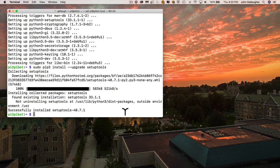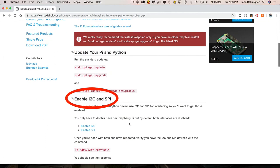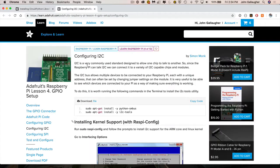When you're done, open your web browser again. Scroll down and the next step refers to enabling I2C and SPI. I2C is pronounced 'I squared C.' These are two mechanisms the Pi uses to communicate with things attached to it, like motors and sensors. Right-click where it says 'enable I squared C,' select 'open in a new tab,' and click on that tab to view the configuring I squared C instructions.